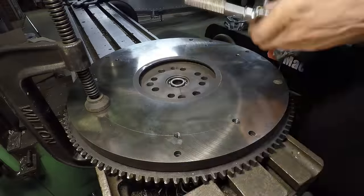Okay, so back here I have the flathead V8 engine that I took that flywheel off of initially. And this engine has the actual bell housing cast into the block. It's all one piece, as you can see here. But you can still see that dimension I'm talking about, from the end of the bell housing right here to the face of the crankshaft. So I've got my calipers here, and I'm going to take a measurement using this ruler. I'm going to put this ruler across the bell housing, and then just measure from here to the flywheel, the crankshaft. And that's right around 3.97 inches.